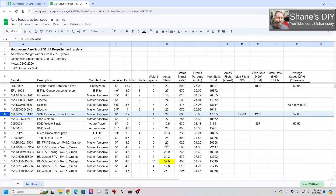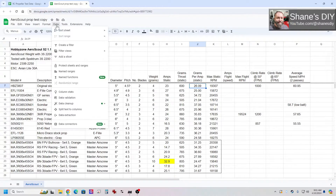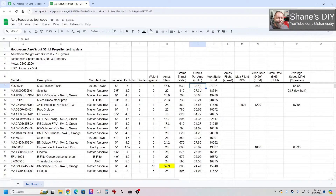Of the ones we just tested, they're all over the board. That one I highlighted was exceeding the 30-amp limit of our ESC. The little lightweight Racing Series had really low amps but not much thrust — lower than stock even. The efficiency number is grams per amp. If I sort by efficiency — data, sort sheet, Z to A — the top one, the most efficient, is that yellow and black Azure Power. Certainly not the highest thrust, but the best thrust per amp — very efficient.